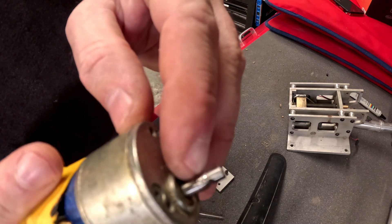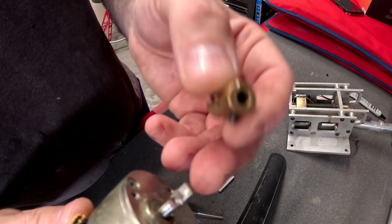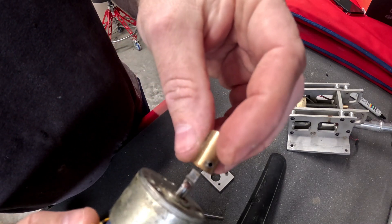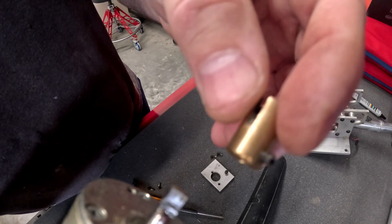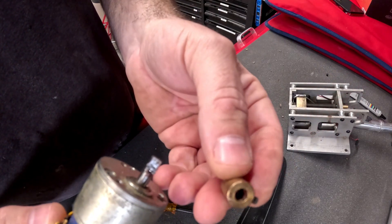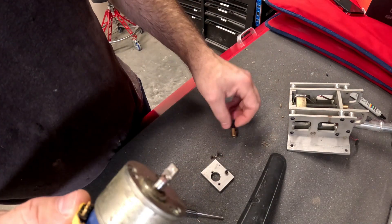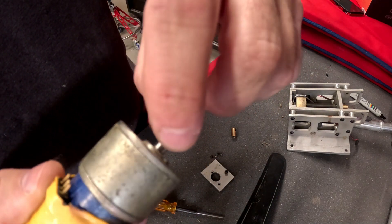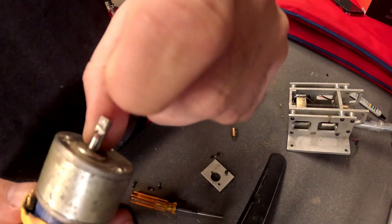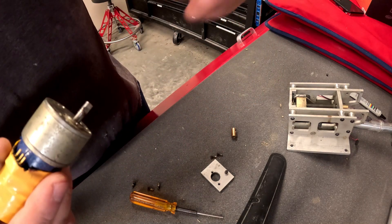You can see all those grooves on the shaft. My guess is this set screw and coupler wasn't on a flat, and they just tightened it up. Over time it has screwed itself onto the motor shaft, gouging the inside of the brass and the outside of the motor shaft as well. I'm going to take this over to the belt sander and extend this flat spot on the shaft.